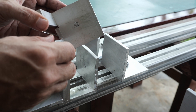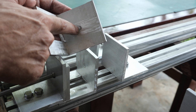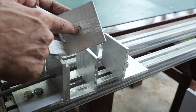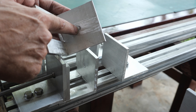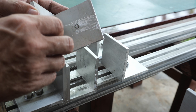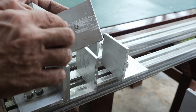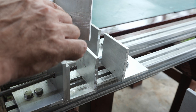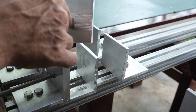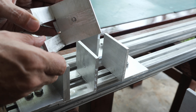To make it really heavy-duty, I will drill a 5mm hole in the marked area, then thread it to 6mm, then countersink it and put in a bolt with a V-shaped flat head. The threaded rod will be riding on the head of the stainless steel bolt, which will make our clamp really heavy-duty.